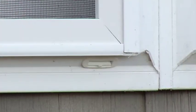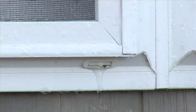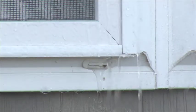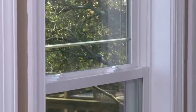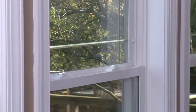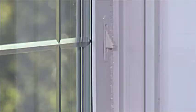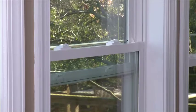Many people are curious about these holes on the exterior bottom part of the window frame. These are called weep holes. They allow water to drain without causing harm to your home. All Window World double and single-hung windows feature vent latches. To use them, just pull them out of the frame at the bottom of the upper sash. They should resemble a wedge with the widest part facing the bottom sash of the window. When vent latches are used, they provide a stop so that the window can only be open to a maximum height of around two and a half inches.